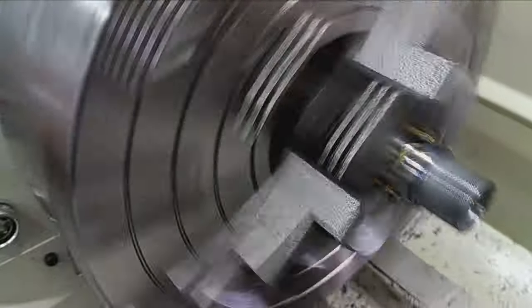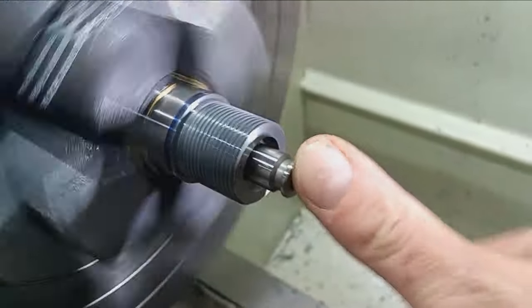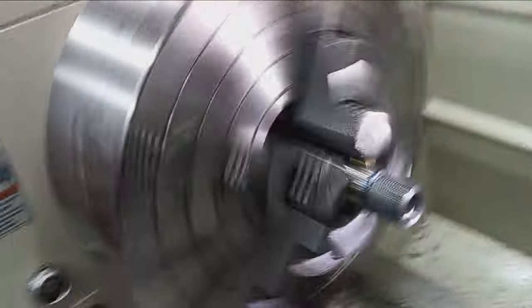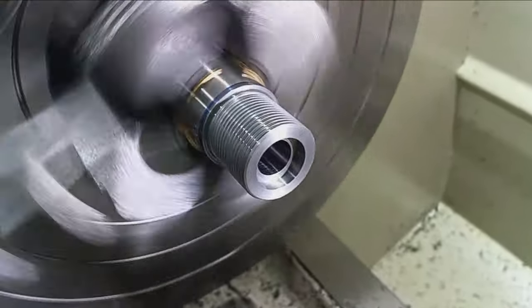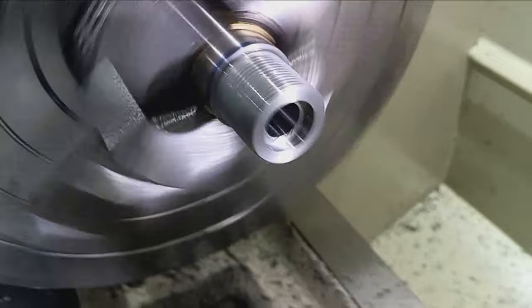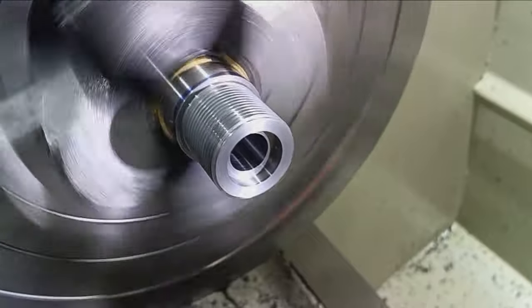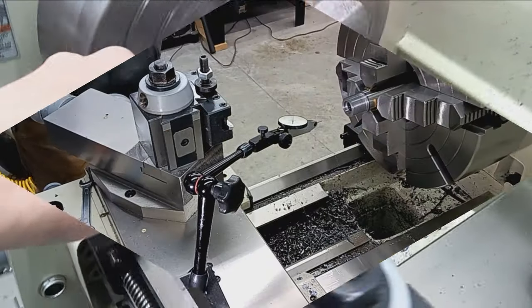Let's get this out of the way, and then grab a go gauge. Show you what we've got. Half inch left or so, 3/8 inch, half inch to go. So we'll check again after a few more passes. At this point, the propensity of it getting out of alignment is very, very small. If anything, it'll happen in the beginning. So yeah, anyway, like I said, just an update on this barrel. 6.5-284. Okay, here we go.